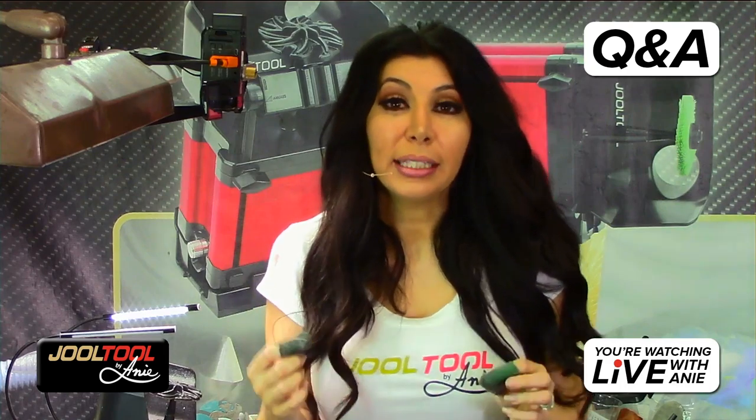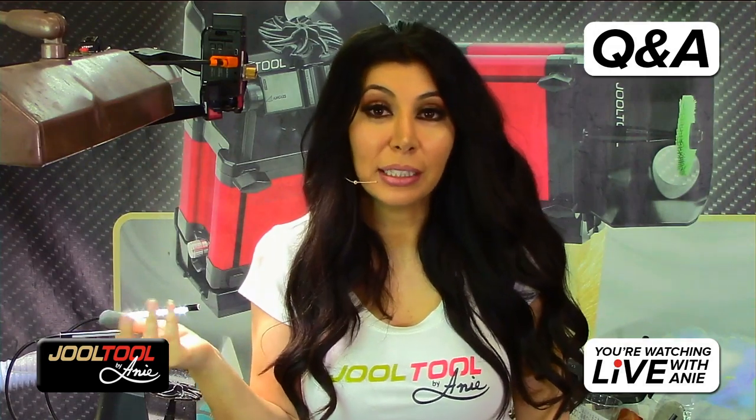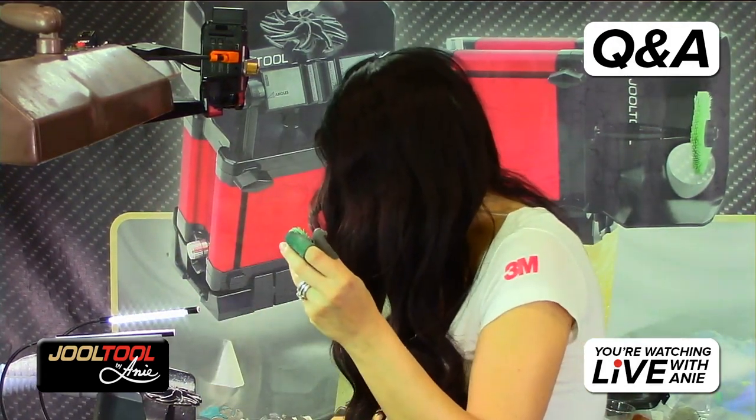Okay, so someone asked, how do you polish the silver after the pickling? Clean off the silver after the pickling. Listen, if you've already polished the piece and you put it in the pickle and it turned a different color, you're going to have two different roads. If it's already pretty polished, you might just want to zippity-doo-dah with the green brush, call it a day, and maybe touch it right after that with the magic buff and you're done.